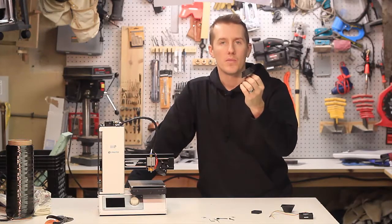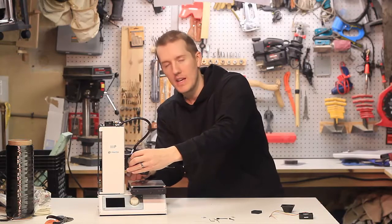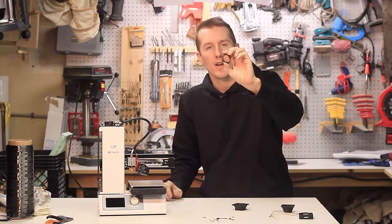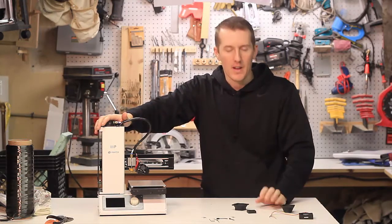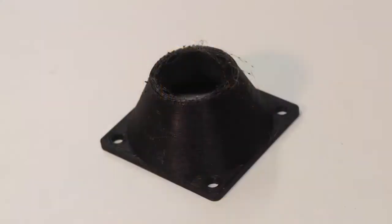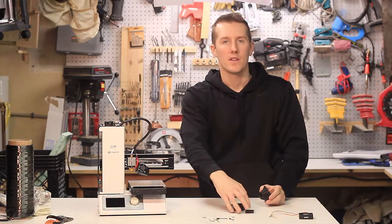I printed off the 30-to-50 coupling and put it on, but I saw it would run into a problem: when the carriage moves to the x-axis, before it hits the switch it's going to hit the case because it's too wide and too short. So I also printed off a 30 millimeter extender to move that flange further away so it clears the white metal case. I also tried a wider flange from another set, but halfway through that two-hour print it clogged up, so I'll print it later.